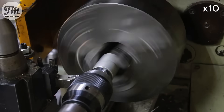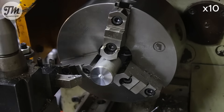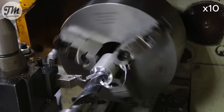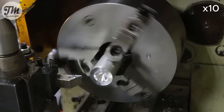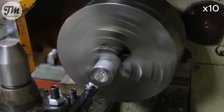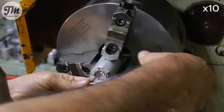The next component is the collar, which acts as a precision guide for the holder. I'm machining it now, and the critical part is holding a 0.02mm tolerance on both the inside and outside diameters. This level of accuracy is essential for a frictionless fit, allowing the holder to travel cleanly on the 8mm guidance and keeping the whole system perfectly aligned.